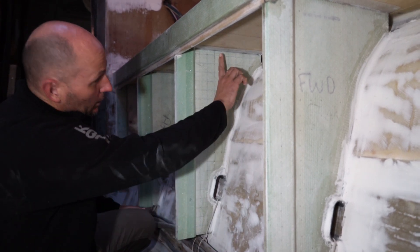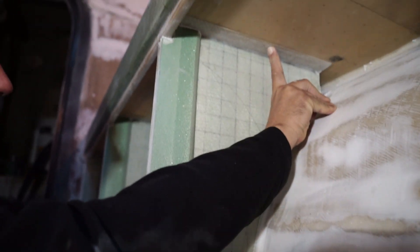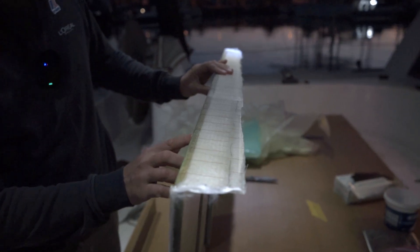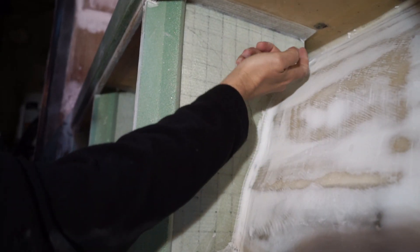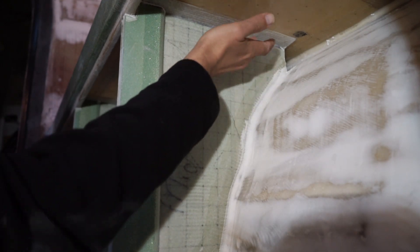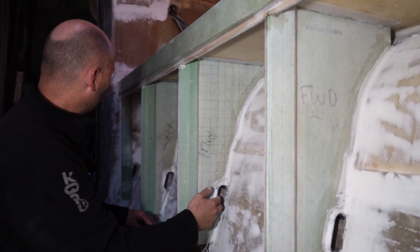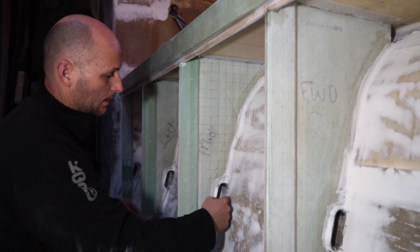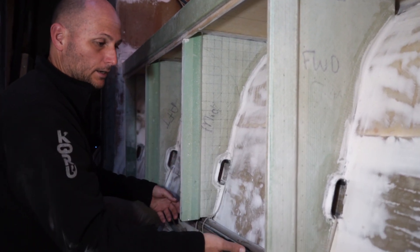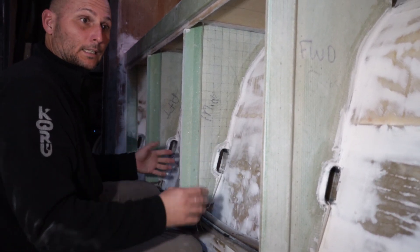I've made return flanges glued in under here. We talked about building flanges into bulkheads and things like that. So here's a classic example - I built the bulkhead with a return flange on it and you can see it's glued to the bunk top. I didn't actually have to tape it; I just pushed this up into place and it was bonded. And then all this was coved and taped in. You can also see where my penetrations through the bulkhead now line up with these penetrations here, where these fluid lines will go. So they're now taken out of the bilges and run into areas which are very easily openable, accessible and serviceable.